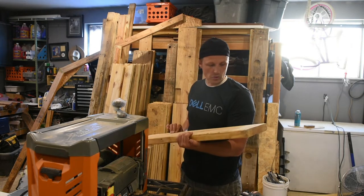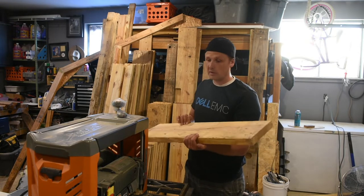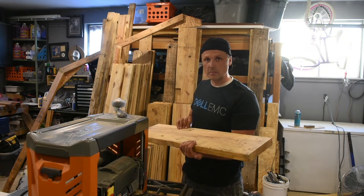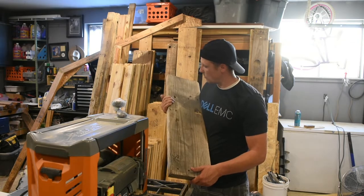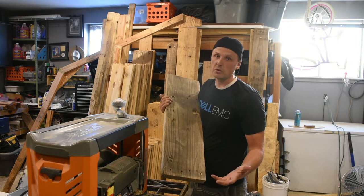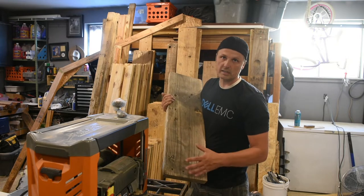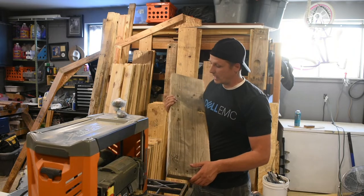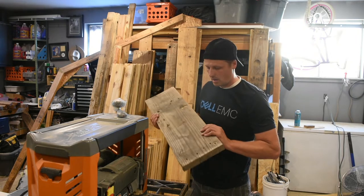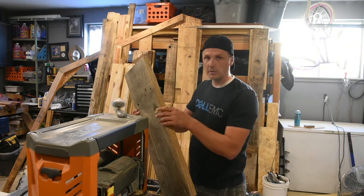I'm being very careful to make sure that there's no nails or screws or anything left in these boards, because I don't want to chip the blades and then have streaks in all my other boards. And I also figure I'll be able to run a heck of a lot more wood through it if I don't damage those blades. So I'm going to make sure that I don't have any rocks stuck in them or anything like that that could damage the blades. Another reason why I'm excited to run them all through the planer is because I'm gonna be able to completely recycle these boards, and I figure when I'm done, it should look pretty close to a new floor, like I used new lumber. It'll also give me a really good surface if I wanted to treat it with something or stain it. I'll have those fresh pores in the wood. So I'm excited to run everything through the planer and see how this works. And I think it's gonna save me a ton of time hand sanding or finding any imperfections once I have the floor in. So let's get going.